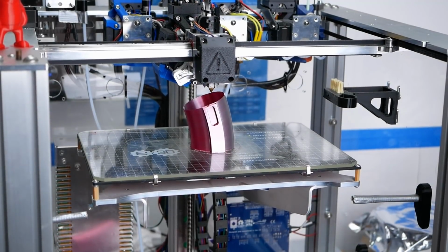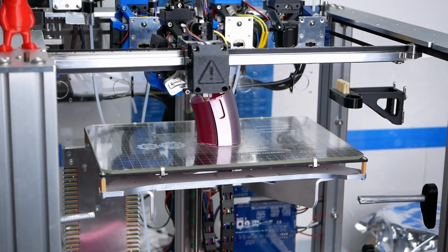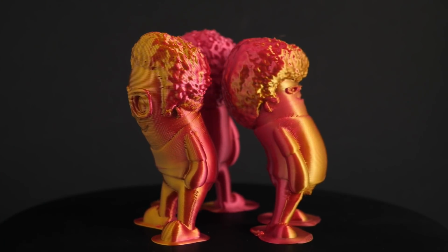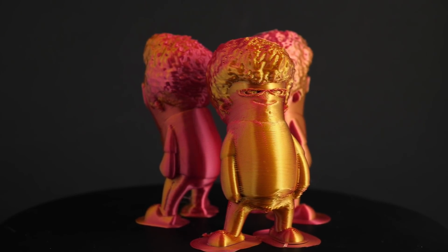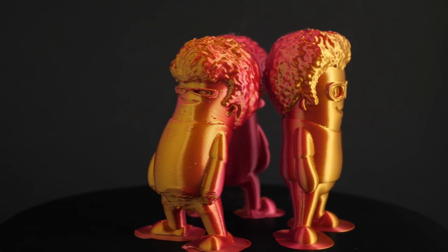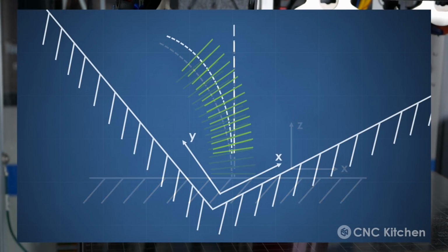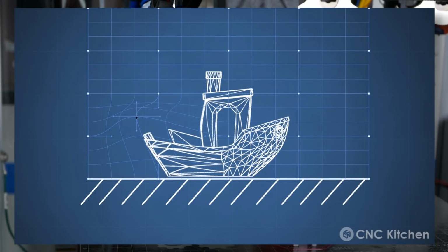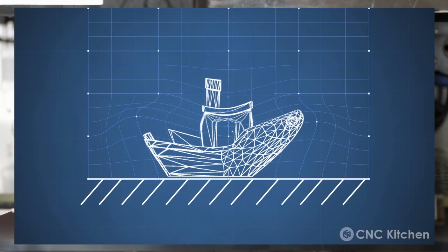My approach is definitely no rocket science, revolutionary, or the perfect solution for all of our non-planar desires. Yet I think it's an idea that can have potential for some applications because it uses a conventional slicer and then just modifies the G-code a bit. I'm currently just bending my G-code on one plane, but you could easily do that in 3 dimensions or just use a mesh over the whole print volume and use interpolation to deform the whole printing space smoothly.